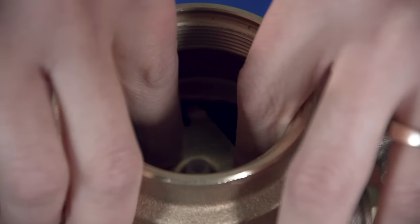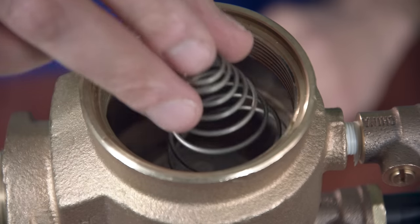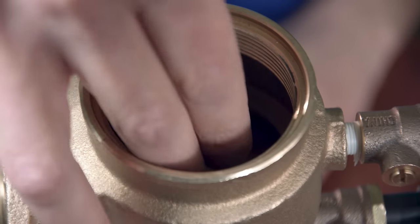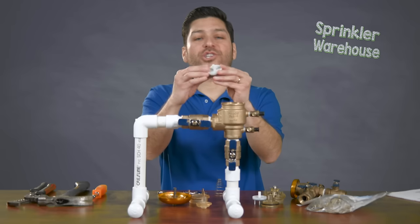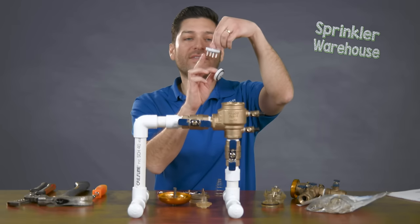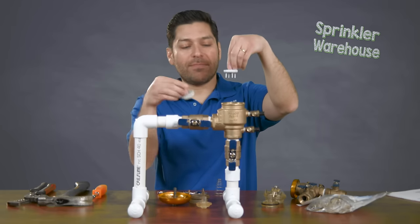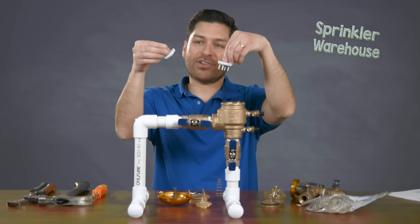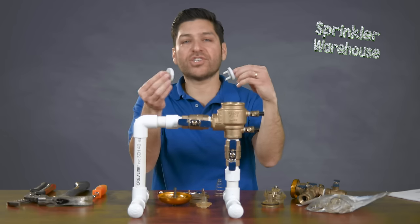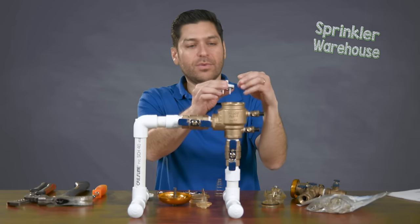While we're already here, we're going to go ahead and inspect the rest of the internals. There's a little metallic groove that holds down the Christmas tree spring that holds that in place. And you'll see the actual check valve — this check valve has failed. As you can see, the new check valve has a couple of guides or legs that go into the pipe itself, and this one has fractured. It's a good thing to check all pieces to ensure you can replace everything so it works properly.